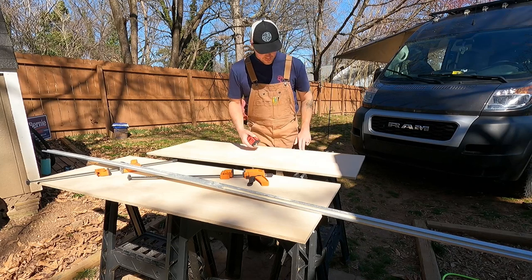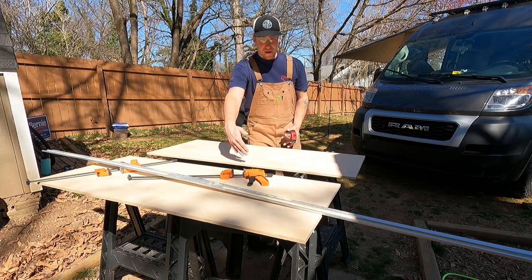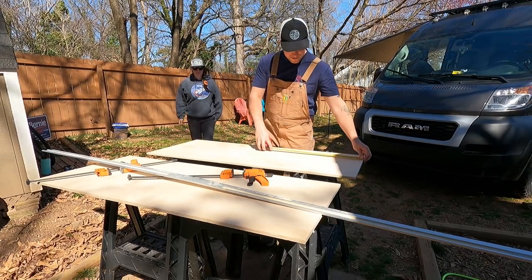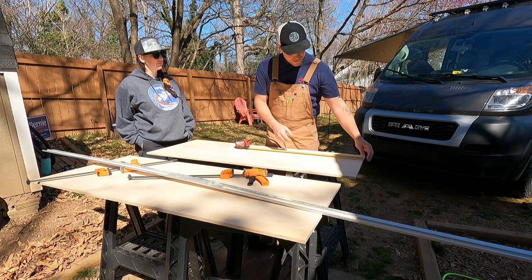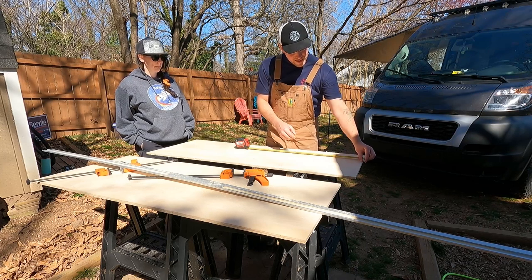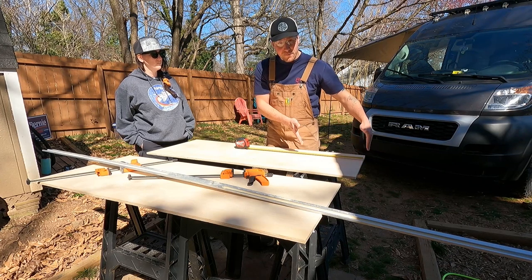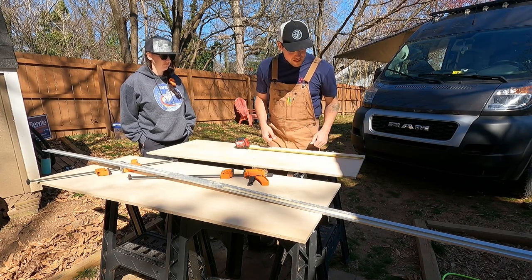We got this one to the bottom width of the cabinets, so these are all gonna be the bottom drawers. I'm gonna make these all 17 inches for the bottoms of all the drawers. They are 17 inches because we will have a half inch on the front and back, making it the full 18 inches deep that we need for our cabinets.